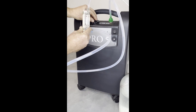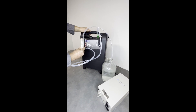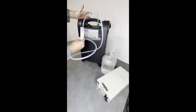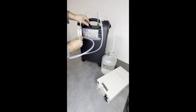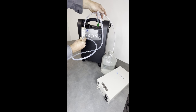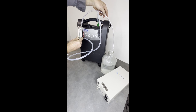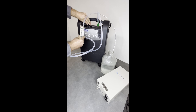At one liter it's reading just slightly above — that's to give a little bit of room for some back pressure, since most applications have just a little back pressure. For most purposes it's going to read slightly higher than what the dial says. Here's one and a half, two, two and a half, three liters a minute. The deeper the diffuser is down in the water, the closer it gets to the actual flow. Three and a half, four and a half, five — you can see we've got a lot of bubbles in the bubble diffuser at that flow rate.